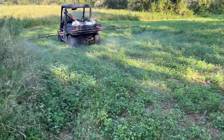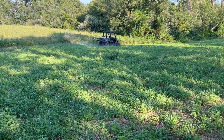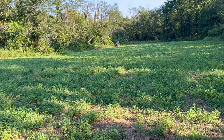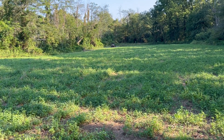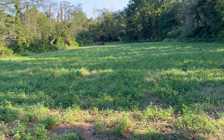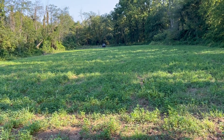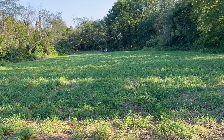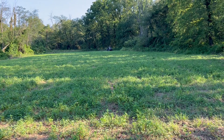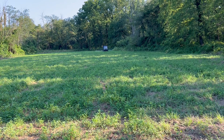We're out here killing some mighty fine looking clover. We've got Blake running a homemade spray rig — we've probably sprayed 40 acres with that thing so far this year. Blake sprayed one eight-acre patch himself, I sprayed six acres of corn twice with it, and Canyon's used it some too. I put an eight-gallon pump on there with eight nozzles on 30-inch spacing, so it should be spraying about 16 to 17 feet wide.